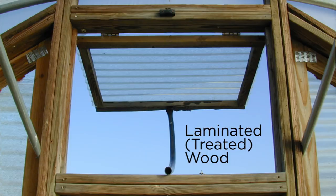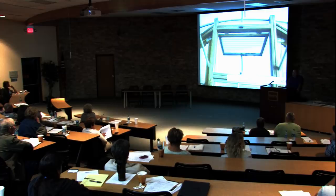If you're certified organic, laminated treated wood is not permissible — you need to figure out some other way, like using linseed oil or something to treat it. But laminating gives you a lot of strength. This is actually one of our first walls we put up — the third wall on the third house — and it's very functional, still out there.